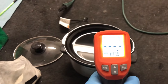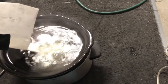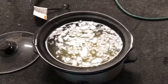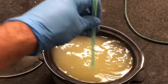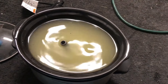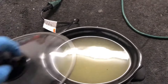All right, so what I'm doing here is putting on a nickel bath remover. It's basically a powdered solution that you can get from Caswell. I'm going to heat water up between 120 and 150 degrees Fahrenheit and monitor that for about four hours. I want to get the leftover nickel out of all the little corners, because if you don't do that before doing the gunmetal finish, the heat to the surface will actually look horrible. So I'm doing this just to be 100% sure it's ready.